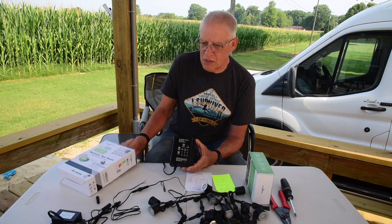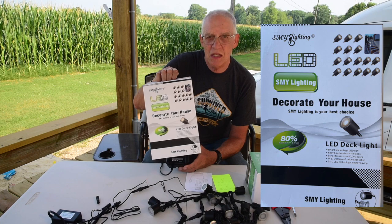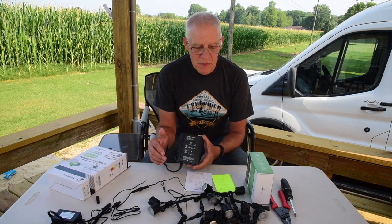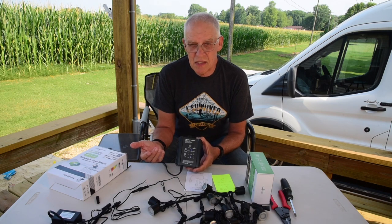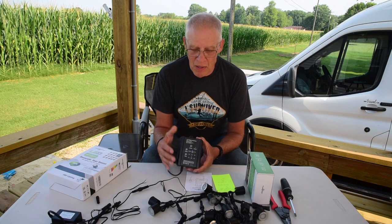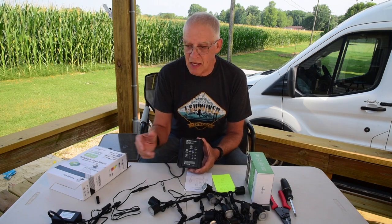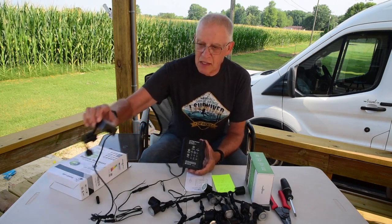Here's a quick example — these are the SMY deck lights. A box of 16 takes only 9.6 watts total, so technically this transformer could run five or six sets and still stay under 80 to 90 percent of its power output.